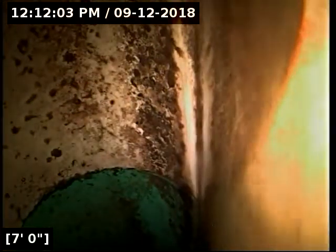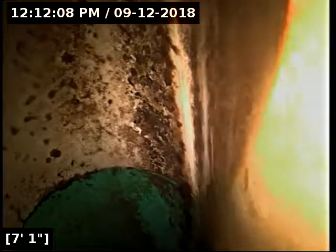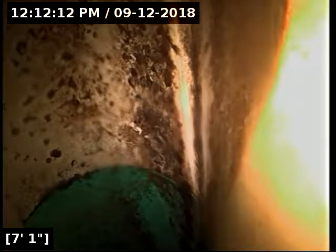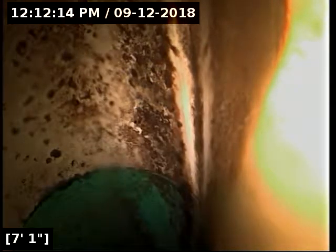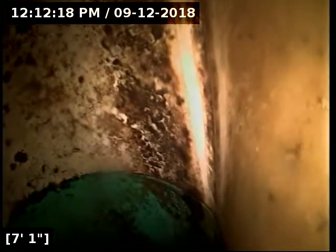Alright, and there is the Y connection. So right now this does appear that it is a shared line by this point. So anyway, you still double check into it. Sometimes you can have things that look like they're partied up but aren't, but I can see water flowing through this right now, and we have no water running in the house we're currently trying to scope. So it does look like either the apartment complex or some property at some point ties into this thing.